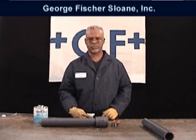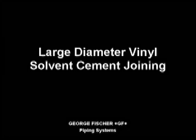Do not disturb prepared joints for a period of time as recommended by the solvent cement manufacturer based on pipe size and environmental conditions. The next segment looks at large diameter PVC and CPVC solvent cement joining technique.